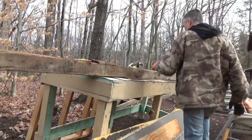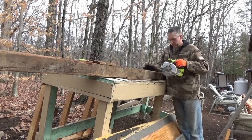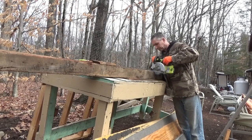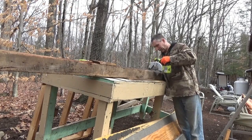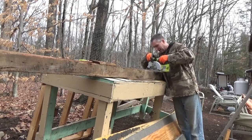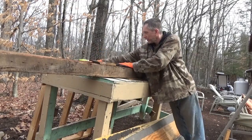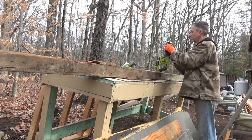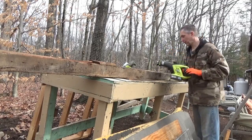I'm using a circular saw. I'm on my 4th cut. I'm using a circular saw to try to get a straight cut, and I'm going to use the reciprocating saw to finish it. It came out crooked somehow. So this old beast will hopefully finish the job neatly. Old wood doesn't have straight edges, so it's really hard to get a straight, perfect cut without a proper table saw or something.